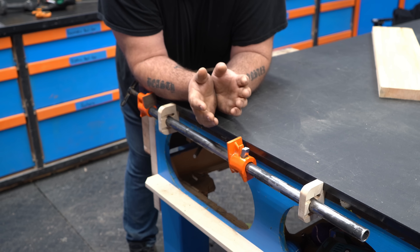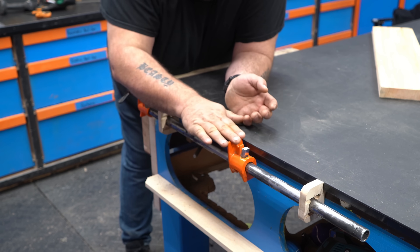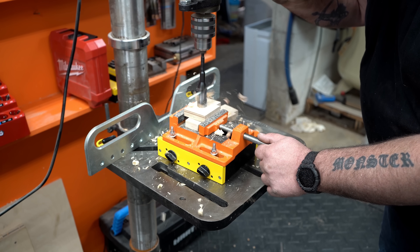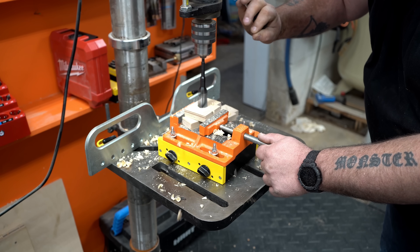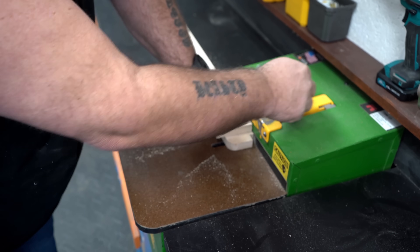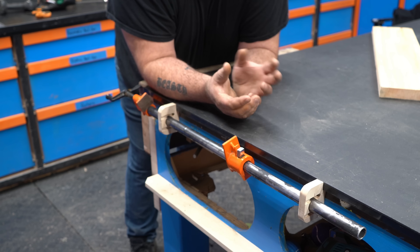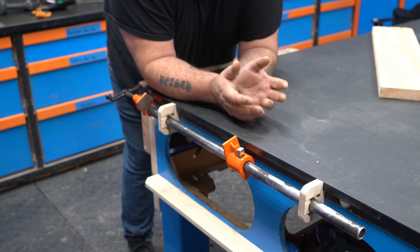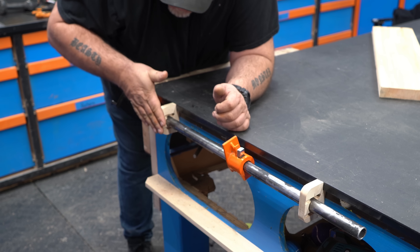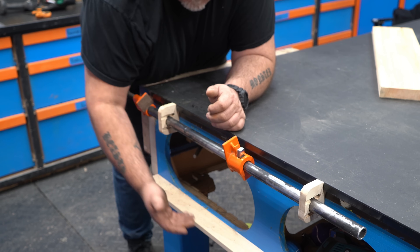Building this system couldn't be simpler. We just drilled some holes in a piece of scrap plywood, making sure the top of the clamps are only about a half inch up from the table when mounted, and far enough away from the bench that they turn out. We drilled those holes over on the drill press, then cut a little relief, put some pocket hole screws in, and mounted this onto the side of the workbench. You'll have to change that mounting scenario depending on your style of workbench. For the bottom piece, we measured out the distance from the workbench and cut a piece the same depth, then pocket hole screwed that to the workbench as well.